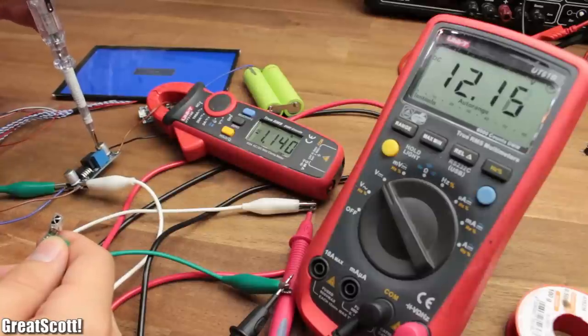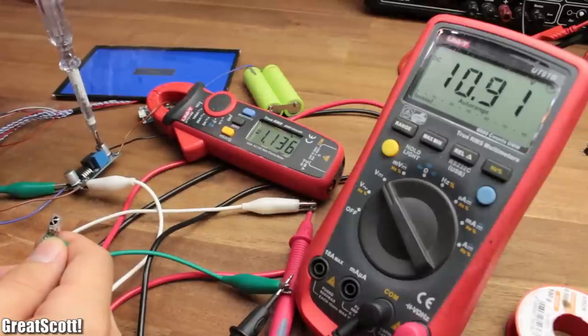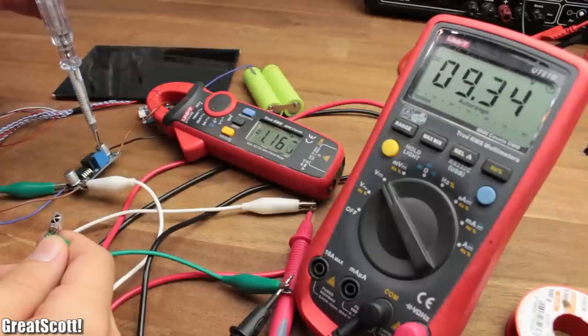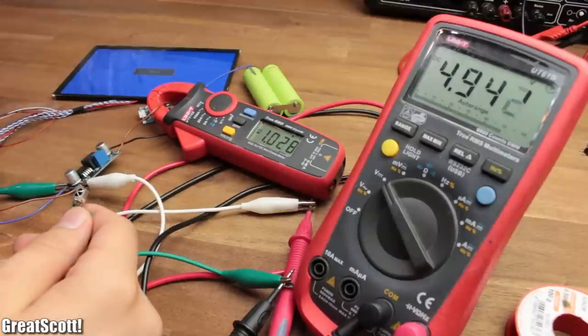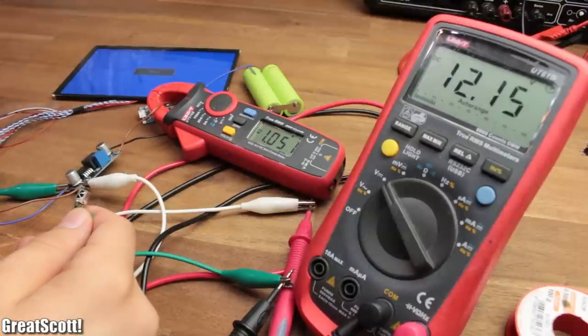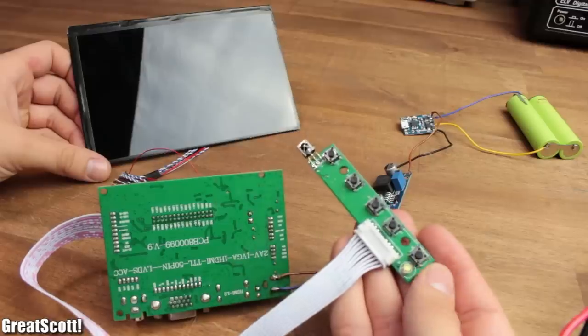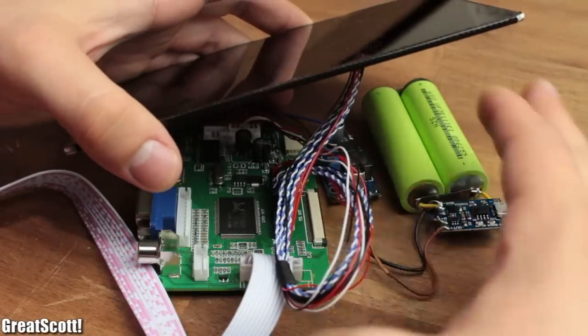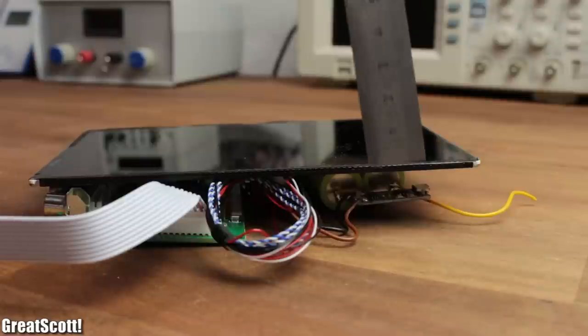To fix the voltage stability issue, I added a small XL6009 boost converter between those two boards. I set the voltage to around 12V and connected it to the input of the driver board. To find the best efficiency of the boost converter, I used my current clamp at the output of the battery circuit and slowly lowered the voltage. As you can see, we draw a bit less current with 5V than with 12V, so let's go with that voltage. This is basically the whole setup inside the monitor case, and stacking them up shows we'll need a depth of around 2.5cm.